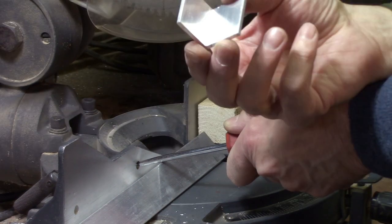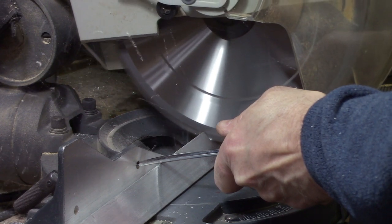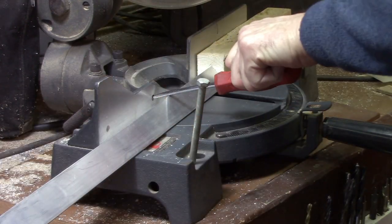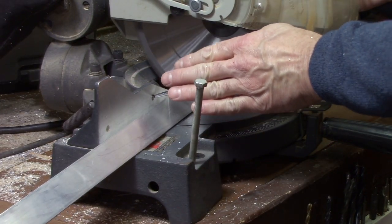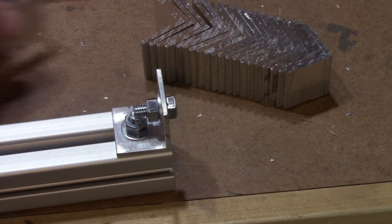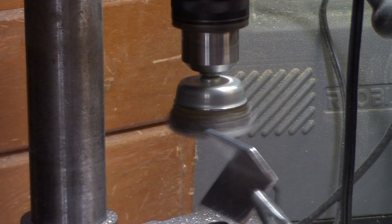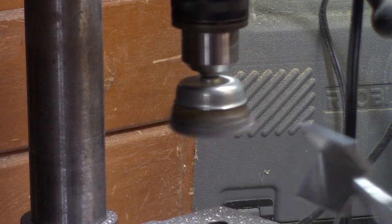Is it time-consuming? Yes. Is it worth it? Yes — the 8020 connectors are ridiculously priced. Make sure you set up a safety stop on your saw. These DIY connectors work just as well, are probably just as strong, and are much, much cheaper. I made these over the course of a weekend and it really is worth it. Make sure you smooth down all the rough edges because they're sharp after cutting — you don't want to get cut on these connectors while putting things together or afterward.